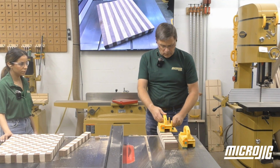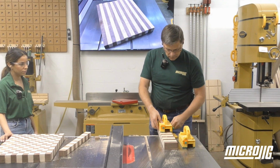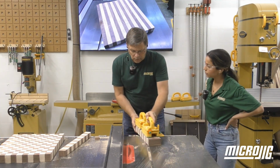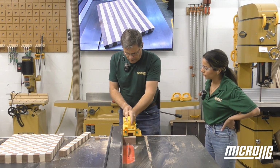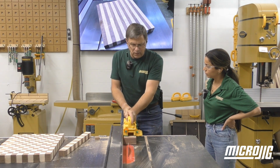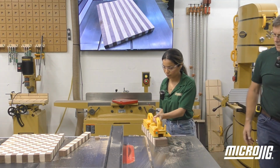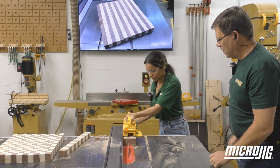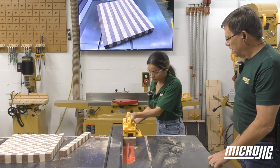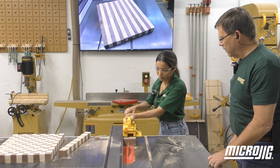Now we're just about where we want to drop the balance support down. So I'll do that here, and we'll add one to this one as well. Now remember, we're going to start over here, and then as soon as this one is capable of being put up against the fence, you're going to keep it there, make your cut. It's just like what we did before. Right, that's good. But it also has to be up on the fence. Always riding the fence, correct.